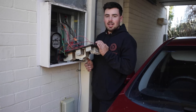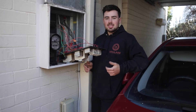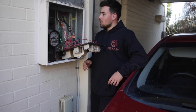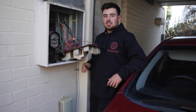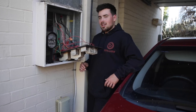Steph's just having a chat with the client. We're going to look to install RCD circuit breakers as individuals — we can group a couple of circuits together on the same RCD, avoid the tripping problem, and they're still protected. I've had a chat with Riley and Geordie and they've had the same situation across all the other units as well, so the RCD and circuit breakers as a combo are going to be the best solution. We might have to make a trip to the wholesaler and get cracking.